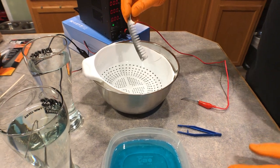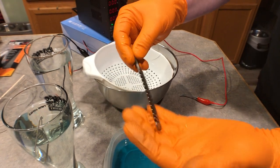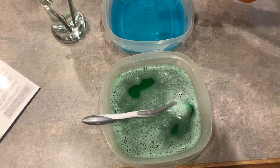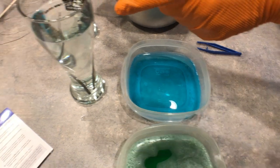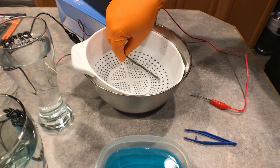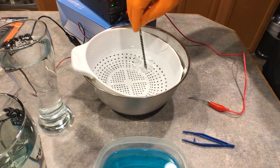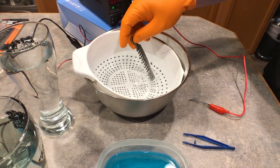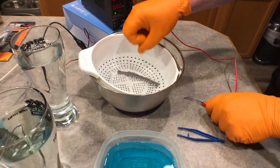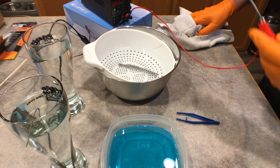I have cleaned the part - you can see it's got a little bit of a shine to it. I've cleaned it with Simple Green and a toothbrush, then Windex, and I've got distilled water in these two glasses. Then I have a mixture of distilled water with baking soda and some TSP, a little bit of both, to make the electrolytic solution. In this particular situation we're going for dark bronze, so we're going to do this at about 15 volts.